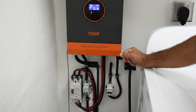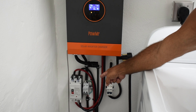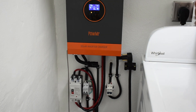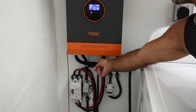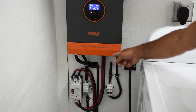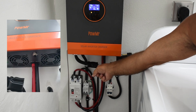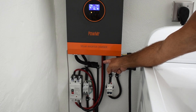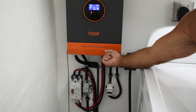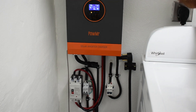The power output is a maximum of 5000 watts. The breaker on this plug is 32 amps, and the plug itself is 30 amps, so that will trip first. I also added a 12 gauge cord with a grounded receptacle, and underneath I added a 20 amp pop-out breaker that only goes to that plug — so if I need to plug something in, I can plug it directly from here. In the event of an overload on this one, that will trip; and in the event of an overload on the other, that will trip if this one does not.